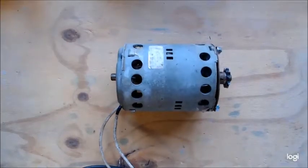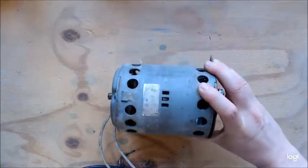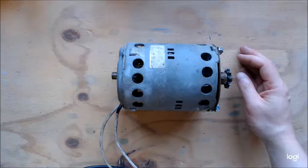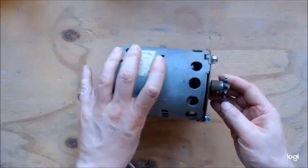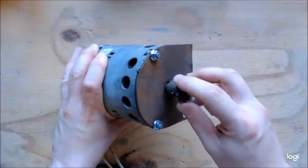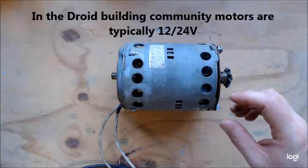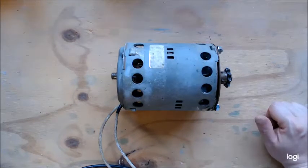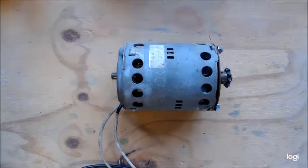This is a motor — it's also quite a big motor. This is a 24 volt, one horsepower. It's an old one I had from my Robot Wars days, but it's good to show a principle. You have the motor body here and the shaft that connects to a sprocket, which connects to a chain to a drive system. Motors are typically 12 volts or 24 volts. You can run a 24 volt motor at 12 volts, but the number of amps it will pull is increased. Amps tends to kill electronics rather than voltage, so you need to be careful.